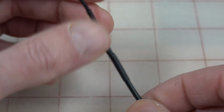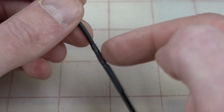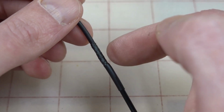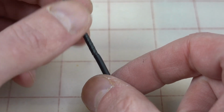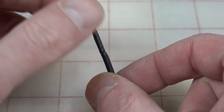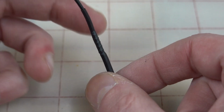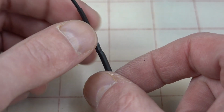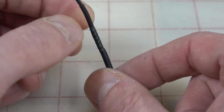Make your joints look that good. That's perfect. It's electrically well bonded. Like, we've got a 1/2 inch of engagement there and 1,000,000 crimps in that type of connector. It's mechanically well bonded, so we've got strain relief, because it's a concern where the floppy wire goes into the rather rigid connector. If this moves around a lot, and it's a robot, it's going to move, that could break off. But having this on there really reinforces that, so that's going to help it a lot.